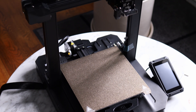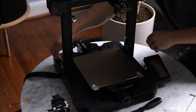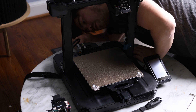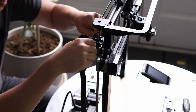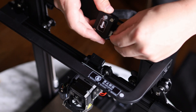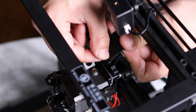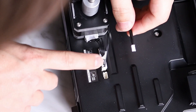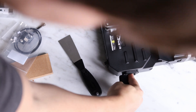With the mechanical build complete I just need to plug all the wires in. Down here I'm going to plug in the screen. Around the back I'm going to plug in the two Z direction stepper motors. Don't forget to flip your power supply to the correct setting — I'm going to switch that to 110. I'll bring up the wiring harness from under the machine, plug in the stepper motor, and plug in the limit switch. Up at the top is the filament runout detector. Then plug in the connector that powers everything on the hot end — pull these two tabs apart, plug in the connector, and push it down so the tabs clamp onto the cable. This connector powers the light and this one powers the filament runout detector. Now I just need to plug in the power cable.